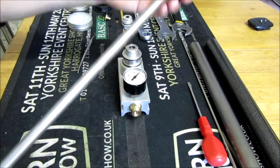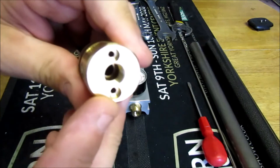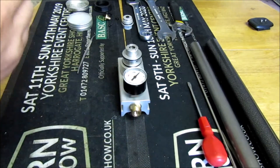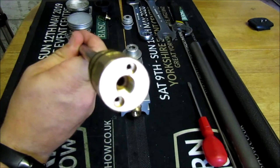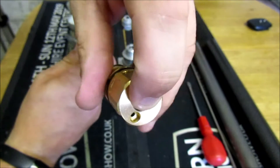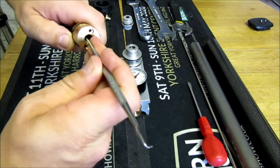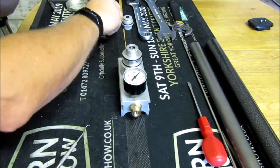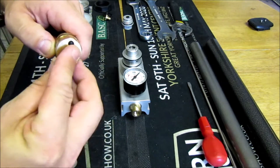This is the inside tube — as you can see there are two rubber seals on the end. Inside the base section we're going to put a brass washer in first, which drops all the way down to the bottom. Then using a small tool, push the O-ring down into the bottom so it seats nicely. Now we have two plastic ball bearings; these two ball bearings sit in these two holes just there.